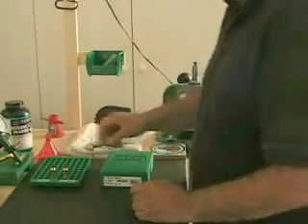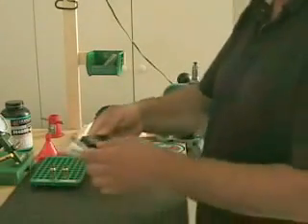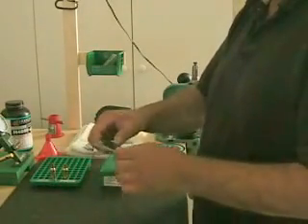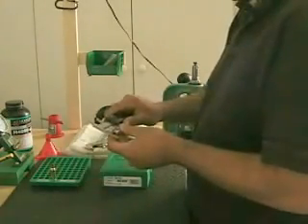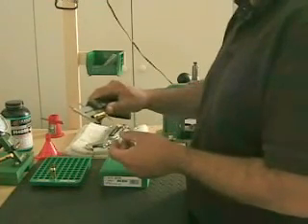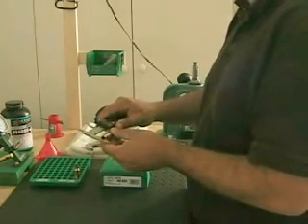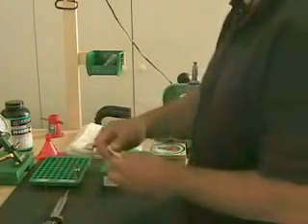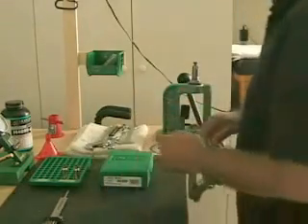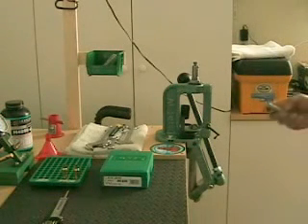So once these are decapped, I'm going to go ahead and prep them. First thing I'm going to do, of course, I'm going to measure it. So take your caliper, turn it on, set it to zero. This is about two and ten thousandths — two and fifteen thousandths, which is fine. It's five thousandths below that. So this is two and eleven thousandths. So first I'm going to prep the cases.